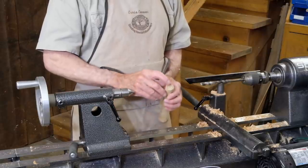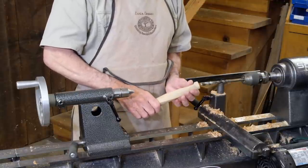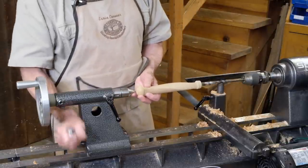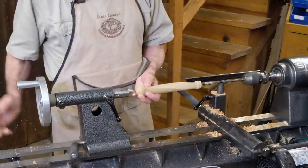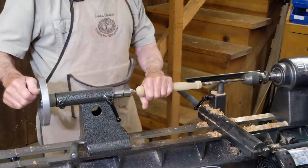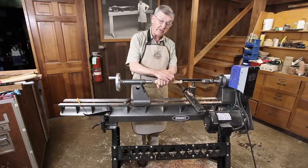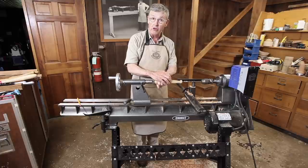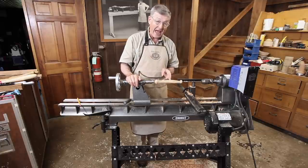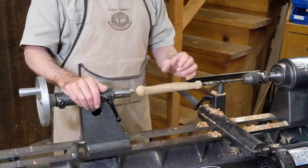This is the best way to drill a spindle turning. Here I have a tool handle — we have the original center marks we turned it on right here. We can simply put that over the end of the drill and use the tailstock to push it into the spinning drill. You want to grip this well beyond whatever depth you're going to drill to. If you want to drill all the way through, such as with a pepper mill, you're going to drill halfway keeping your hands clear and then turn it around.